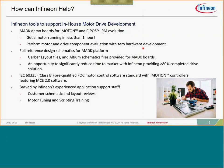We provide the hardware, but we also provide the full reference design for these boards. From our website you can download Gerber files, Altium schematic files for these MADK boards. This significantly reduces time to market because we're essentially providing 80 percent of the completed motor drive solution from essentially day one. On top of that, our MCE software is UL Class B qualified, which eliminates a huge portion of your development work for code qualification. All the key safety protections are already built in.